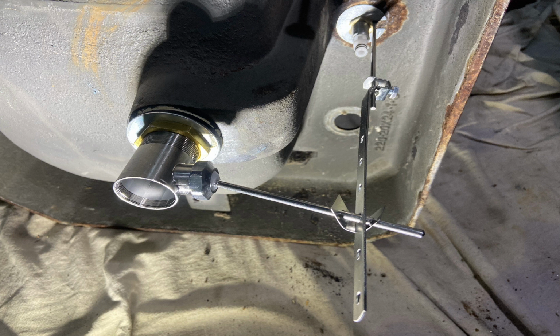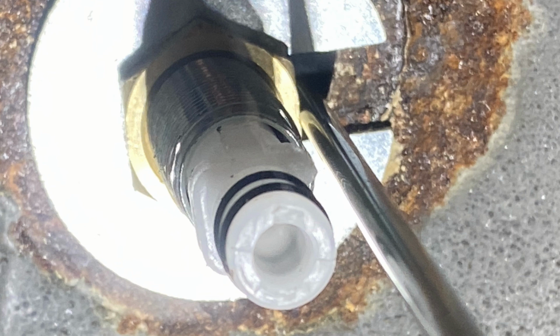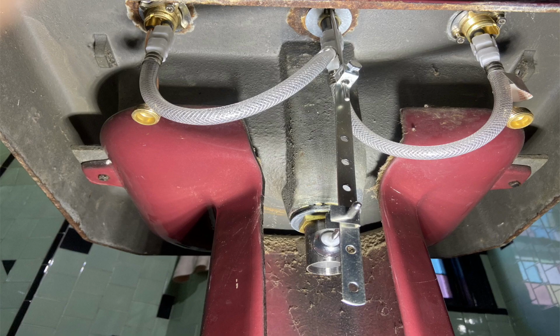And then I like to get that all lined up before I put the sink back. I don't do my adjusting later. I do it sooner. Then, I put the nozzle of the faucet in, and I just generally snug it up with my basin wrench. And then you have to play with it because you have to get that pop-up rod to clear the nut and the washer. So it's a little bit of a pain in the butt. But anyway, I got it done.